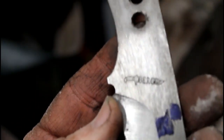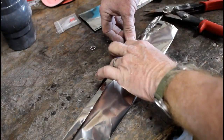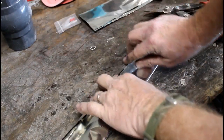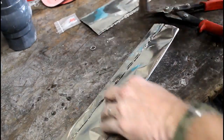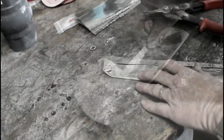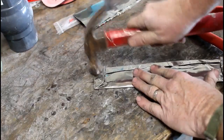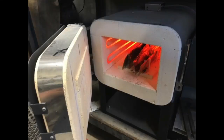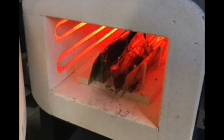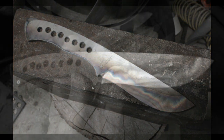This is a stainless steel blank, so it's going to get wrapped in stainless tool wrap. Create as airtight an envelope as possible by double folding each one of the seams and really creasing each fold — you do that on the main seam and both sides. Be very careful when you work with this stuff; it is razor sharp and will literally slice you up. Basically I put it into an even heat oven at 1950 degrees for 15 minutes, take it out, plate quench it — clamp it between two plates and blow air over it to cool fairly quickly. It goes in for a sub-zero quench in dry ice, and then two tempering cycles in an oven at 395 degrees for two hours each cycle. You let them cool slowly overnight without opening the oven door.